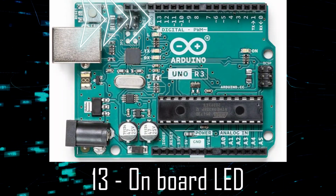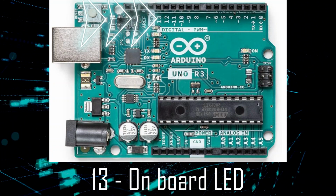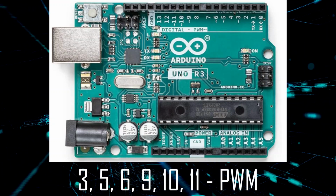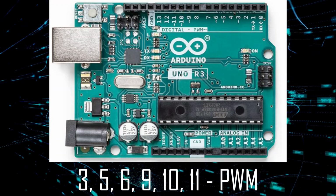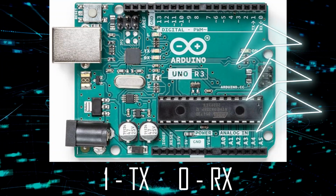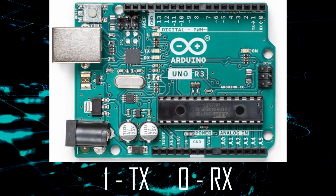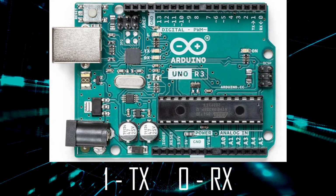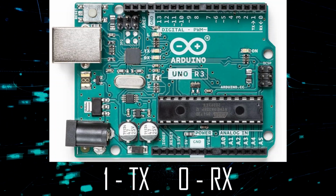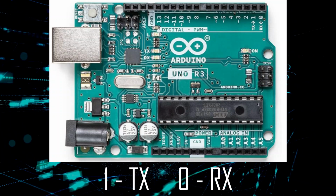Pin 13 has an onboard LED and resistor attached to it. Pins 3, 5, 6, 9, 10, and 11 have 8-bit pulse width modulation capabilities. Pin 0 can be used to receive TTL serial data, and pin 1 can transmit TTL serial data. Serial communication is used to exchange information between serial devices like monitors, security cameras, printers, or GPS devices, and the Arduino.